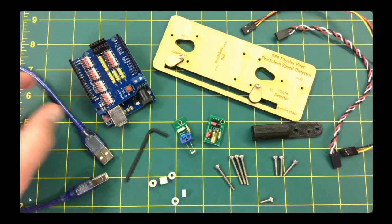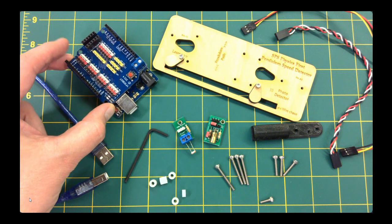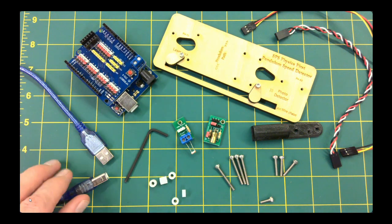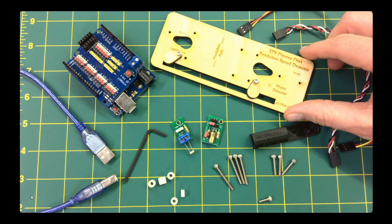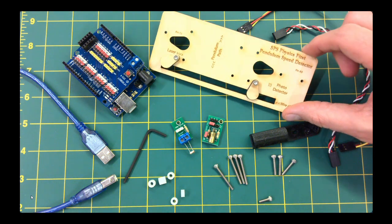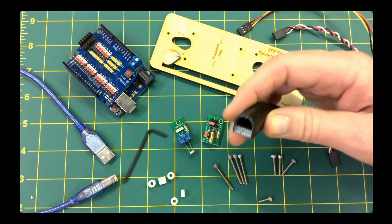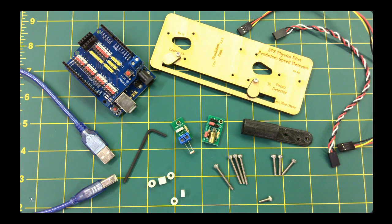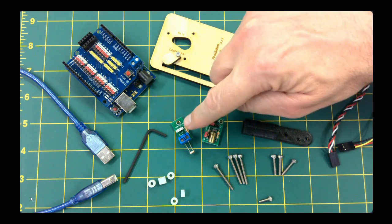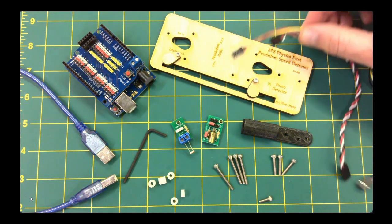Gather your materials. You will need the Arduino Uno with a sensor shield attachment and a USB programming cable. You will need the laser-cut Pendulum Speed Detector board and the 3D printed light shield, both of which you can download in the description below. You will also need a laser board and voltage divider light sensor board. And don't forget the two 3-conductor cables.